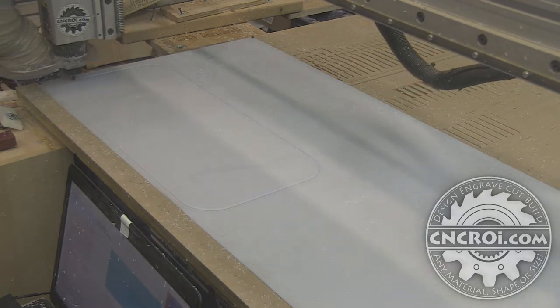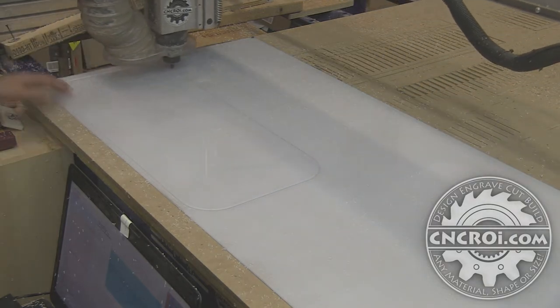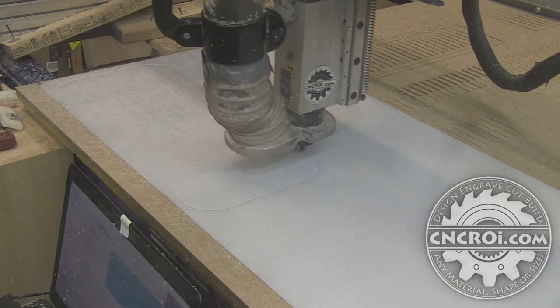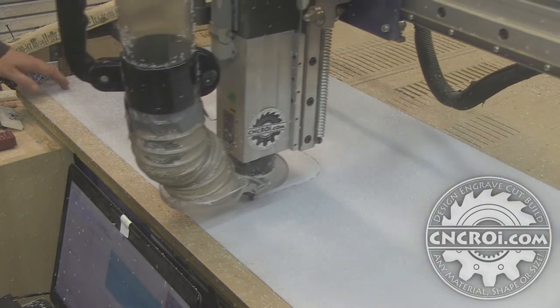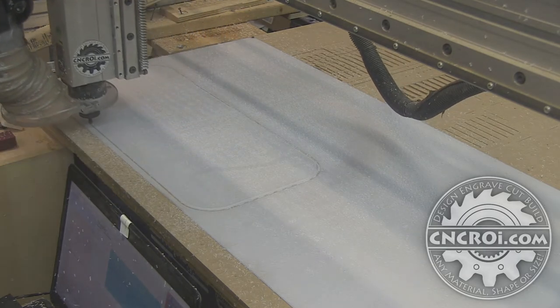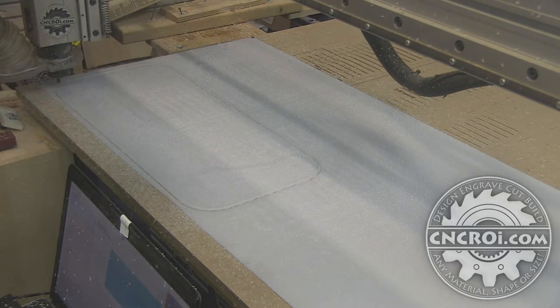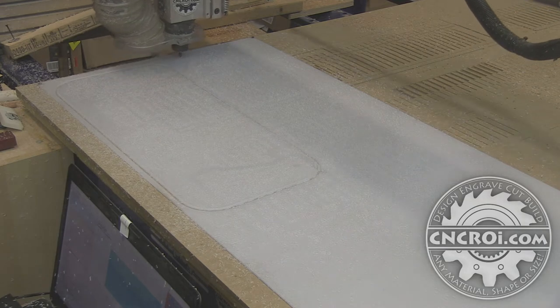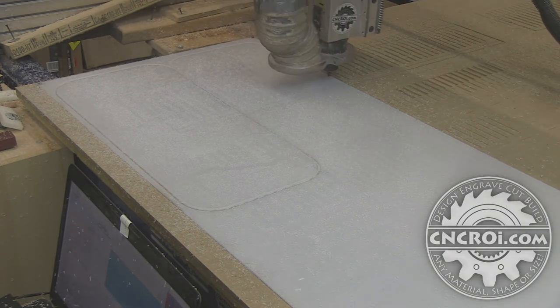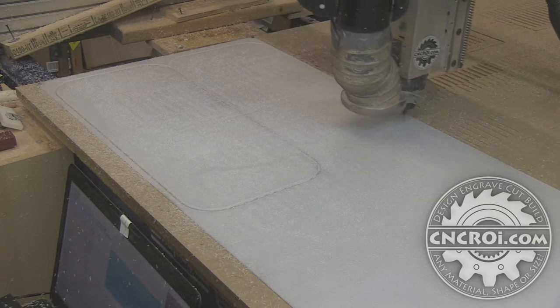For this job there are two processes. I'm just showing the first using the angled bit. After that, there's another pass going down roughly 1/32nd to cut out the rest of it, because the profile calls for an angle but also a straight edge. It's so minor it just looks like the router is moving and nothing's really happening, but it's actually cutting it out.